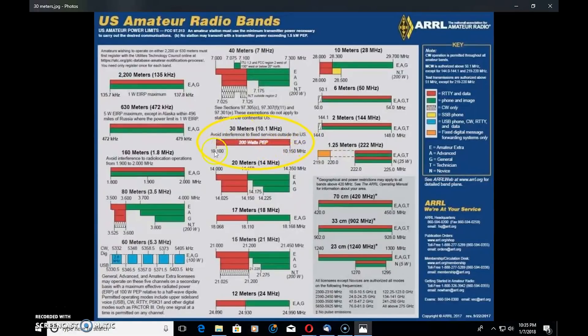Now with the 200-watt limit, it levels the playing field a little more for CW and digital modes because the average transceiver is 100 watts. Picture on 20 meters, you can have somebody running five watts QRP and somebody running 1500 watts full legal limit — and when you're trying to compete with someone using 1500 watts, it is impossible if you're using five or 10 watts. With the average radio being 100 watts, it wouldn't be justified to fire up an amplifier to get an extra 100 watts, because you're only getting 3 dB or half an S unit gain. And if you're using PSK31 or JT65, you're not running 100 watts anyway — you're using 25, 30, 35 watts, maybe less on FT8 or JT65. CW might be different, but that's the 30-meter band.